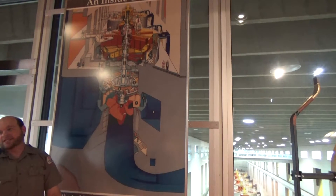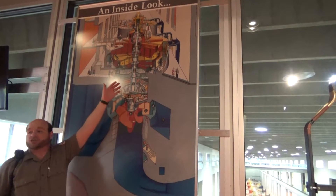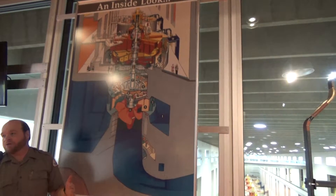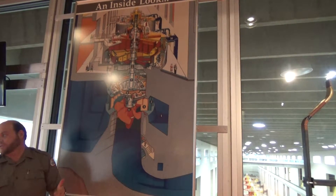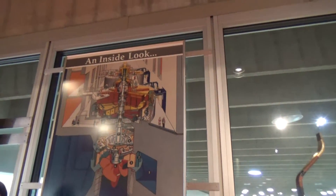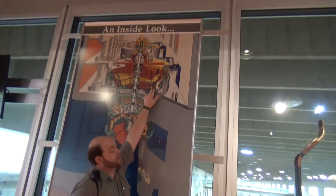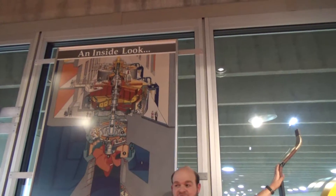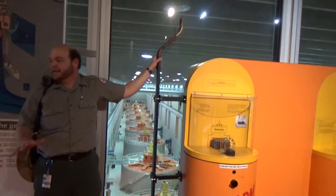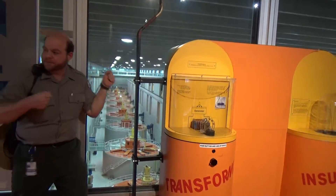The rotor is a big disc — you'll see it — spinning at that same 70 RPM. On its outside edge are 105 electromagnets. They've got north poles and south poles, just like the magnets you're used to; they push and they pull. As they spin, they push and pull against more than 500 copper coils lined up along the outside. These coils are static — they can't move — and those magnets spin past them, pushing and pulling.